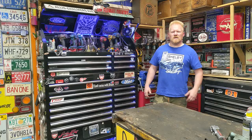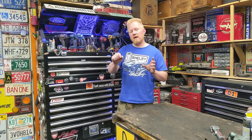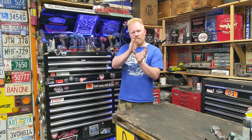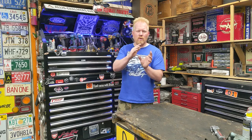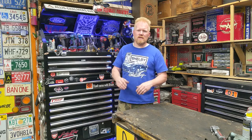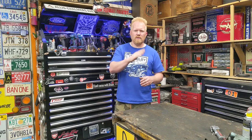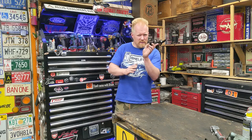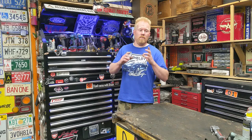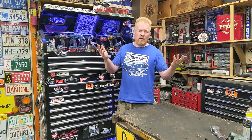I was able to lift and let the vehicles down, move them around a little bit. Every time I repeated it, I got the exact same results — the pressures stay the same, which is good. I do think I need a lower PSI gauge so I can have a broader sweep and a bigger area to see exactly what the PSI is — then maybe I can see 665 more precisely versus a gauge that goes up to 3,000 where you can't really see that close. But I'm able to get accurate results and I can watch the pressures on the machine as well.